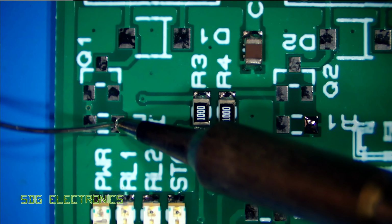Interesting from the point of view of the graph that's on the front of the unit, basically we saw the power start off right near the top and then it started dropping down. And that's because initially the coin was cold, so we had to put lots of power into that coin, but then it basically reached the same temperature as the soldering iron, so the power going in there is basically just replacing the losses, basically to ambient and to the PCB that it was sitting on. So yeah, works really well.